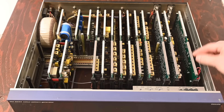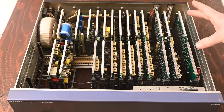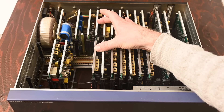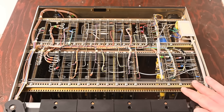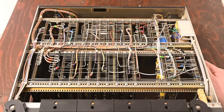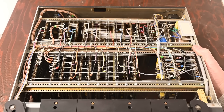Last up is the clock, which we won't look at again, but one thing worth mentioning: it has no character generator on it. What it does is send control signals to the text generator instructing it to put characters on screen at the appropriate point in time. Flipping the unit over, we're looking at the backplane — to me one of the most interesting parts — the whole thing is completely point-to-point wiring. It's just absolutely extraordinary how much work would have gone into this, and it really tells you the sort of league the Danish Philips was in. It's such a shame when these things get scrapped because all that effort is just lost.